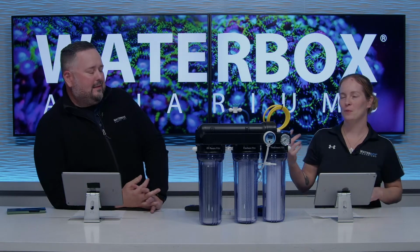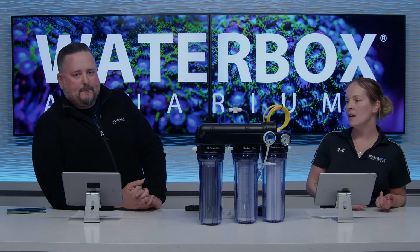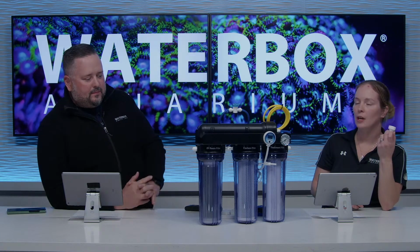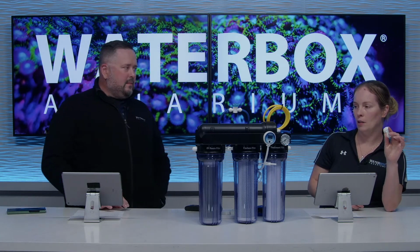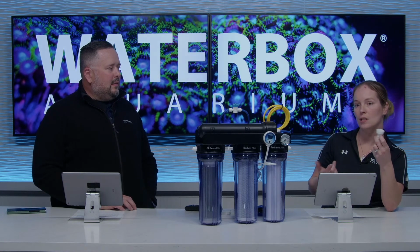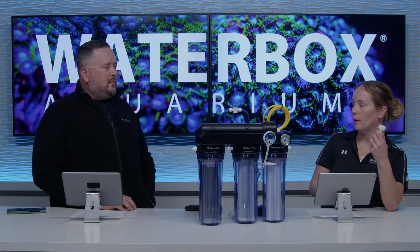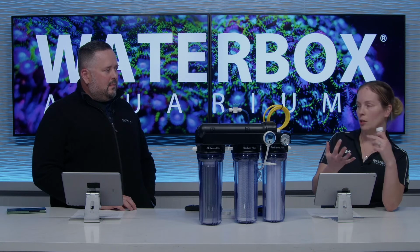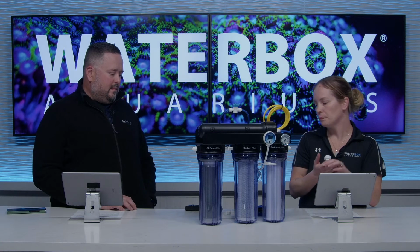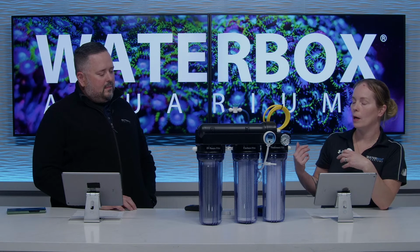All right, so perfect. RODI unit, you have a couple different ways or places that you can put it. If you want to make water just as you need it, it can hook up simply to a faucet, a hose adapter, anything like that. The RODI unit comes with a general faucet adapter. If your faucet's a different size, you can get an adapter from a hardware store and work it down. So this is just going to be, okay, I need to make water, let me set it up, washing machine line, kitchen sink, wherever, with this adapter. From here, if you're setting it up that way, bring out your unit, make water, put it back away.